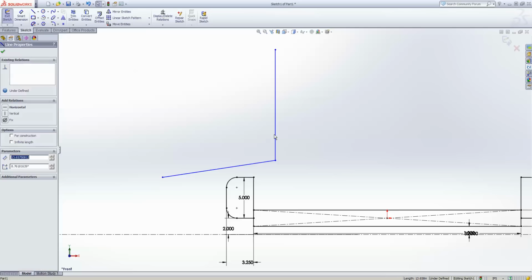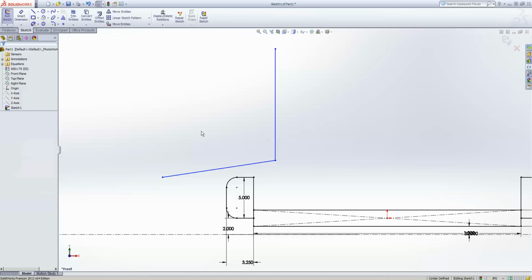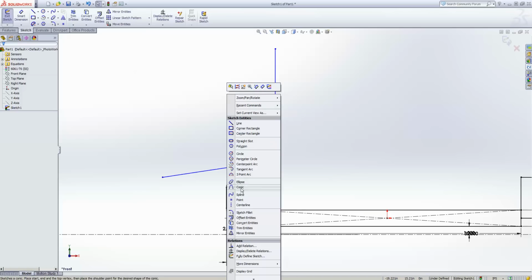Instead of picking holes and seeing what the resultant motion is, I won't dimension where the holes are for moving stuff. I will dimension the motion and let that pick the holes for me. You're going to have to use your imagination, because when I first start these things, I start with all lines, and then once I get things finished up, I'll make a line a rectangle to show a tube and that sort of thing, but I always start with lines.